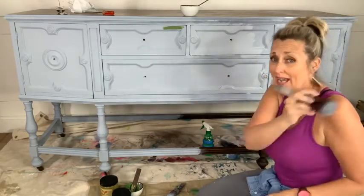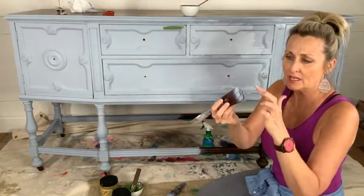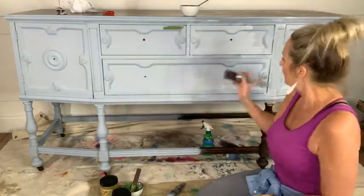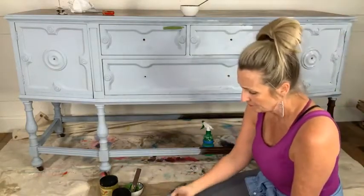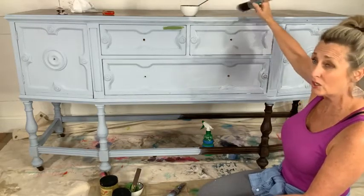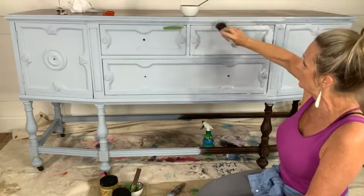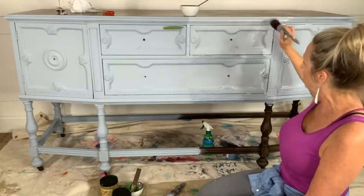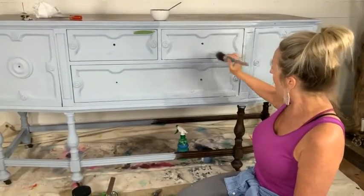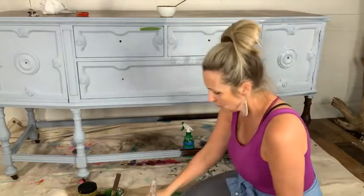Whereas if you brush back and forth like this, you're spreading it one way, and then another way, and you're taking the bristles and running them through, and you're making like highways through it. You know what I mean? So if you do this and stay out of it, you are just delivering it, sort of like how you get that beautiful finish with a sprayer, but I'm just not a sprayer. I don't enjoy spraying. So I just go over my second coat just like this, whether it's paint or primer, and this is what I call a pounced or stippled finish. I can already see the little mountains just starting to lay out, and it really levels out beautifully.